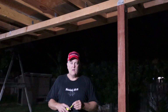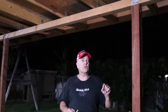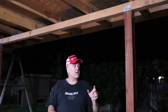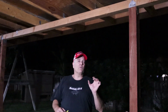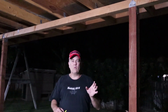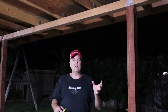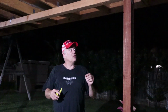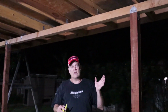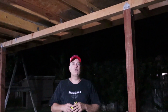Let's talk about hardware. Now, all of the screws, I said this in my last video, all of the screws that I used on this were deck screws. Those are coated to be used outside in decks, especially in pressure treated stuff. That way they don't corrode and rust away. If you use regular drywall screws, guaranteed in 5-6 years those things will start rusting away, especially if they get any moisture on them or are exposed to the elements at all. Those things will rust away and turn brittle and fall apart. So you really need to go ahead and spend the extra money. They're about double the price of a regular drywall screw, but you need to use deck screws that are coated for outside use, and they'll last 20 years.